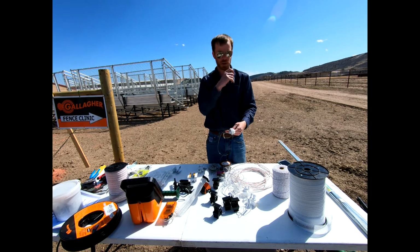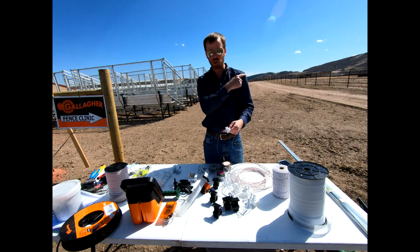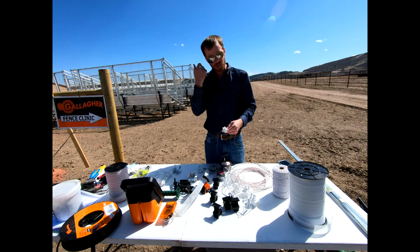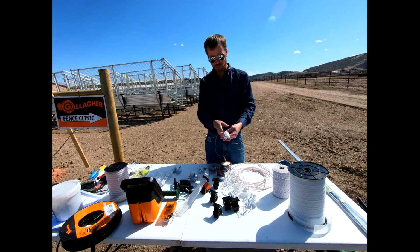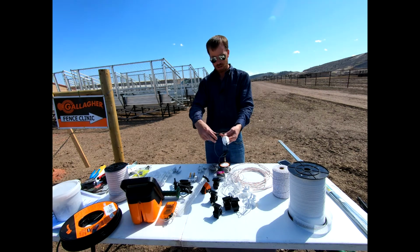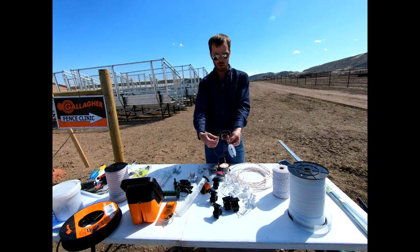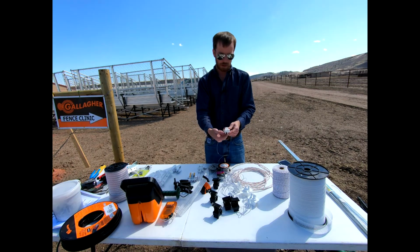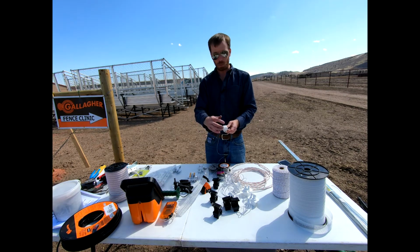Maybe we're going to go to the other side of our steel pipe over here just for this demonstration today. We can't ground out on that steel pipe. We need it to be insulated. Easiest way to attach it is going to be just a simple plastic insulator like this, okay? This wire right here can wrap around our metal post, could wrap around our wooden post, and then separate from that, we can then put our poly line in here, or maybe this same aluminum wire, okay?